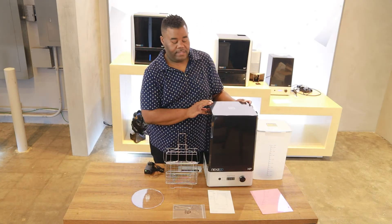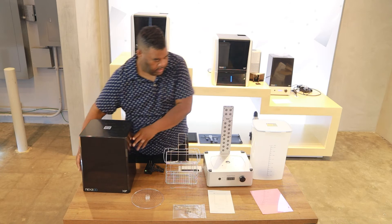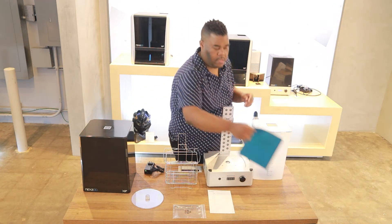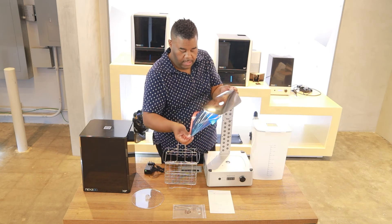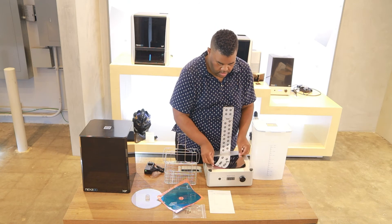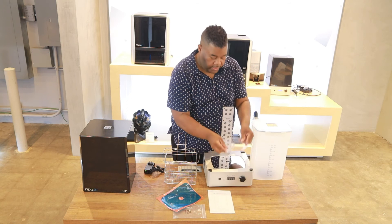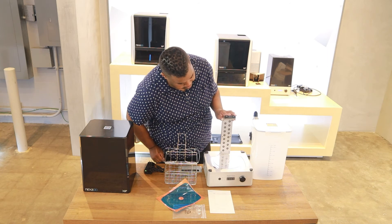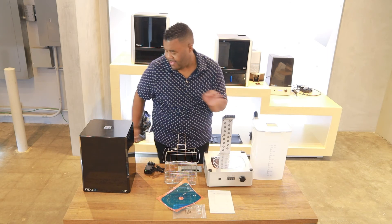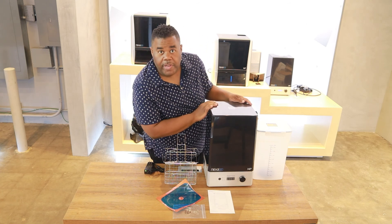To convert to a cure station for your washed prints, remove the UV light cover and peel the reflective film. Next, attach the carousel on top of the reflective film. Be sure to angle the LED lights down towards your part, then replace the UV light cover. Now you're ready to cure.